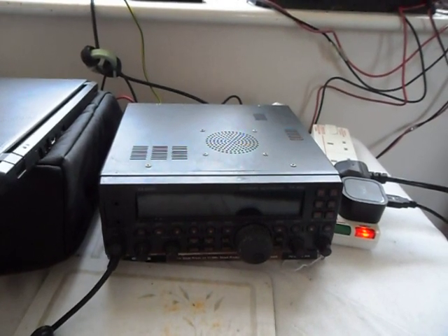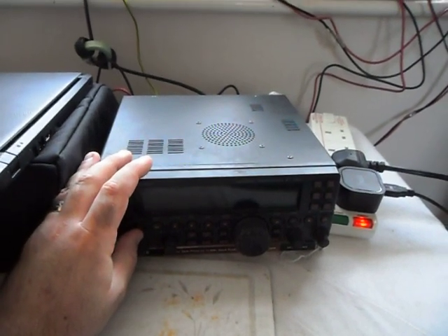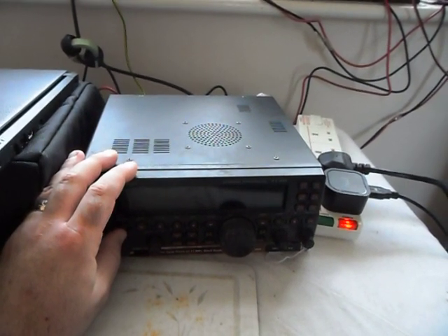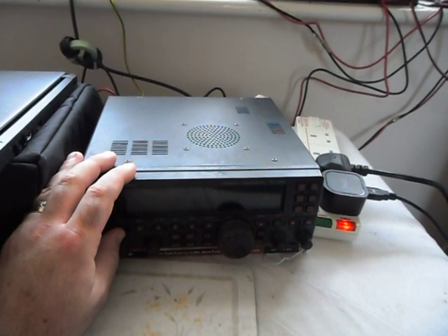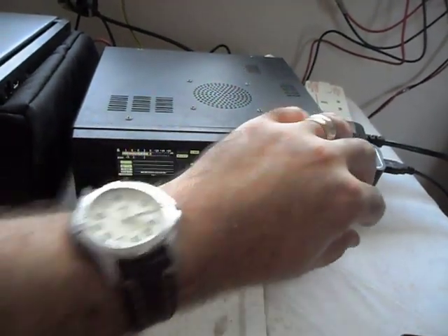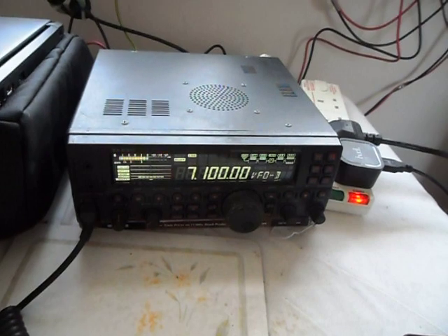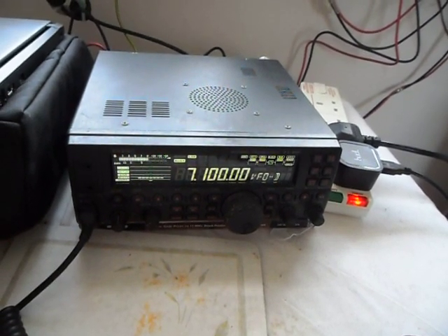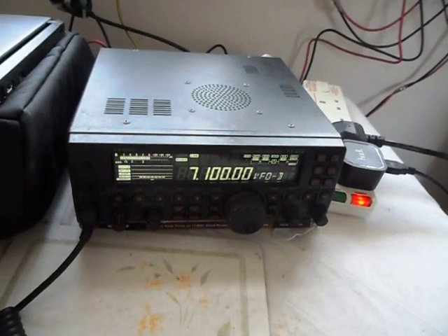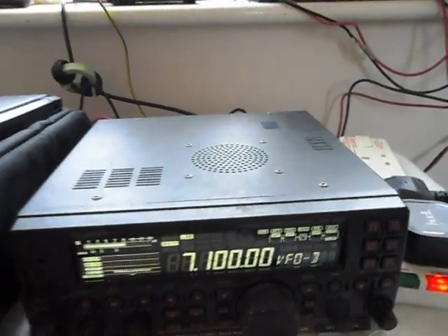The thing that I thought was actually a fault is a pretty neat and sensible safety feature. I'll turn the 450 on - it's on the 40m band, which is the band I basically live on if I'm going to go on HF. There is a nicely resonant half-wave inverted V dipole connected to it, so no antenna matching unit is necessary. There's a bit more noise today than normal - I've got S9 of noise because I'm using a battery charger and a switch mode power supply nearby.